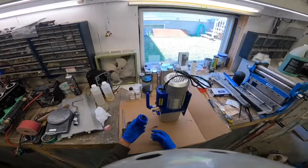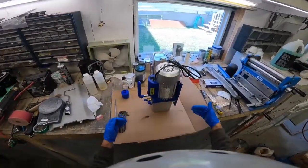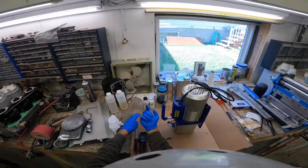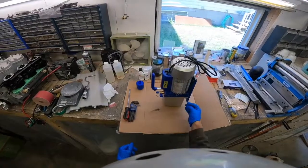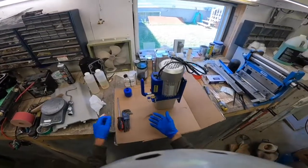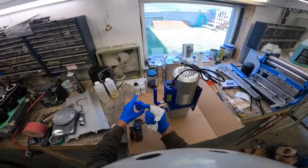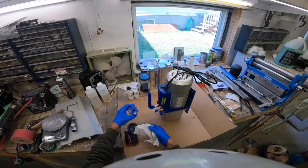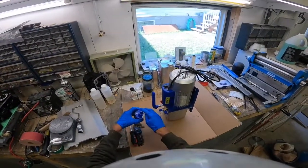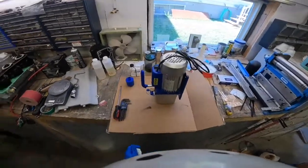This piece here just threads off by hand. There's an o-ring around the bottom of it. This is kind of like an air filter but what it's designed to do is trap the oil vapors on their way out — kind of like a PCV valve on a car. You have air venting out through this area and there are oil vapors that come out with the pumped air, and they don't want that escaping for two reasons: one it would get on stuff, and two it would make the oil level drop quite quickly.